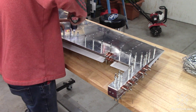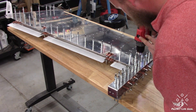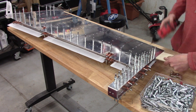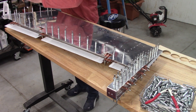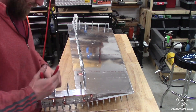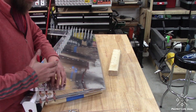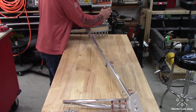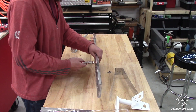The trailing edge of the ribs do have a few holes that you actually have to drill 100% through the rib stock using the pre-punched hole in the skin as a guide. Using an electric cordless drill really is not the best tool when you actually need to drill a fresh hole like that — I have to take my time and be extra careful so that I don't make the hole in the skin out of round. I may invest in a pneumatic drill just for those circumstances. If you've already built an RV7, let me know in the comments if you think that would be wise and if there are a lot of that style of holes to drill once out of the empennage.